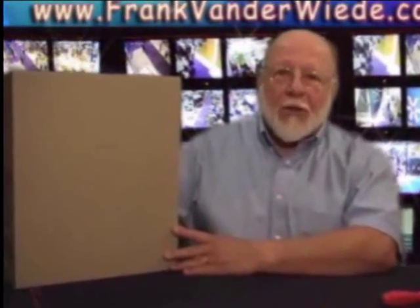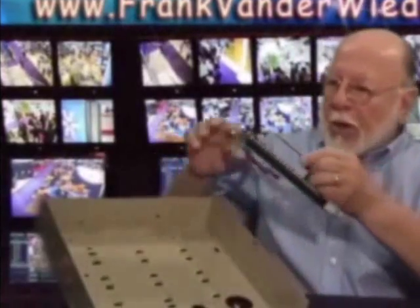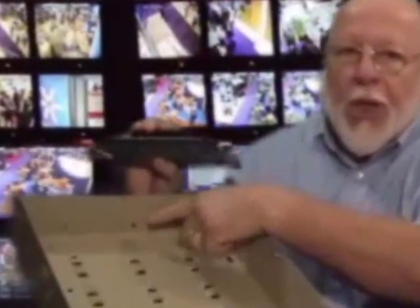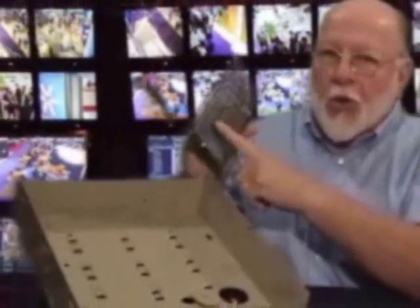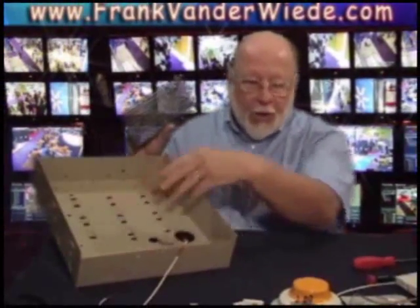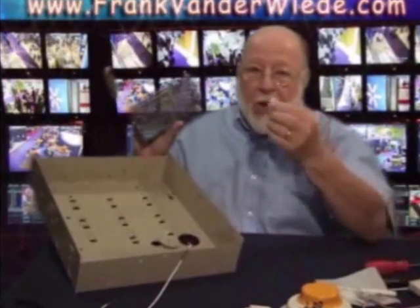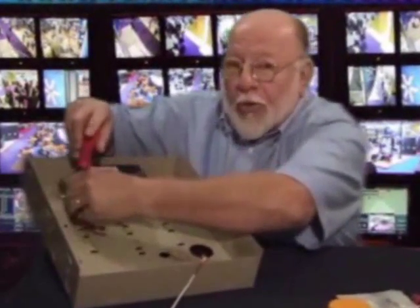Now let's go to the control panel itself. Once your cabinet is attached to the wall, you can go ahead and mount the motherboard. You'll notice there are some little standoffs here — those are made to raise the board up off of the back of the cabinet. You don't want any metal from any of these solder terminals to touch the metal of the cabinet. Inside your little bag of parts, you'll find two plastic standoffs. It's not necessary to over-tighten.